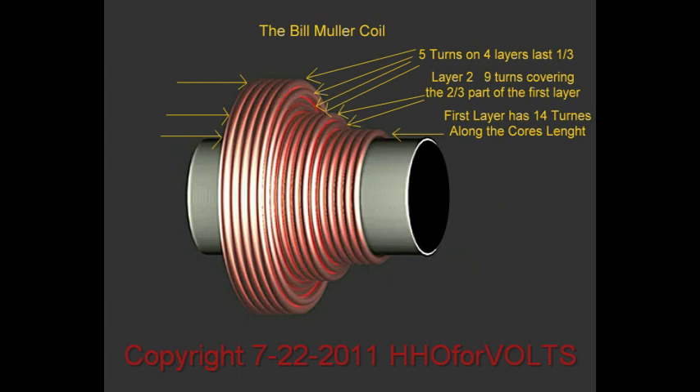He's using a magnetite core, which we have made. As for ferrite cores, we found some Soviet surplus with a permeability of 800 — as far as permeability goes, it is way superior to the magnetite core. But the magnetite has its own advantages. When you pour your core unit, you need to make sure it is magnetically aligned — that's not a hard thing to do.